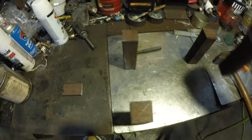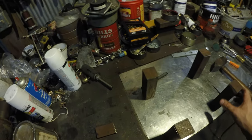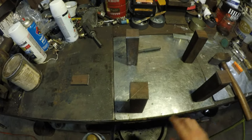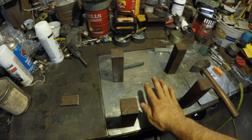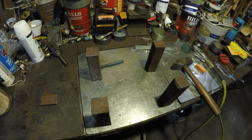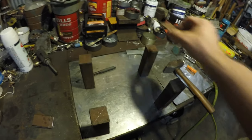What I plan on doing is drilling a hole in here, welding a nut on the bottom so I can weld these together, and then I can thread a bolt straight into here. Then I can run a piece of steel across here underneath the bottom so I can box these in as well. I can just set the battery on and slide it in on the side - I'll put a stop at the end, a backing plate in the front and back, and a plate on the bottom with a couple of drain holes. I think I'm gonna leave the sides open.